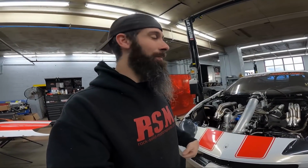The more stainless you have involved in a setup, the more movement you're going to have. Just like an exhaust system, whenever it gets hot, it grows a lot. A system that's from the headers all the way back, you get that much stainless involved and you throw the heat to it, things are going to start moving around. So the shorter you can keep things, the less movement you're going to have. But at the same time, you don't want to have little stubby primaries because a good long primary will increase the efficiency of your air pump or your engine.